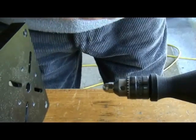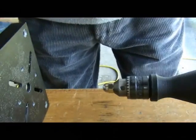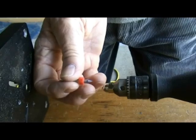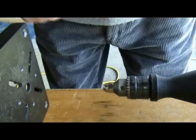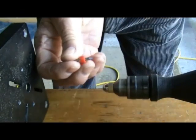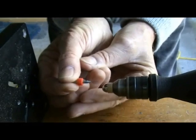I've actually done this in 0.3 as well, so it is achievable. I'm going to bring the drill up very gently and it'll probably oscillate a bit until I find the center, but when it does find the center it will be dead still and then you can just enter the drill. By the way, I'm running this at about 75% of its speed — it needs to be fast, that's the important thing here. So here we go.